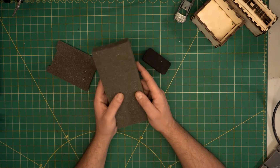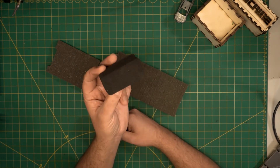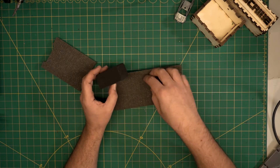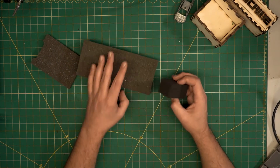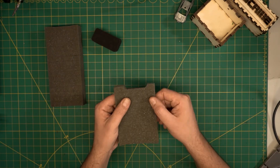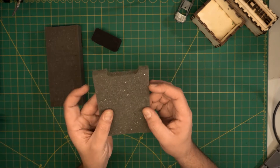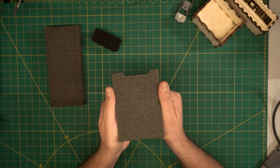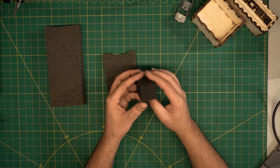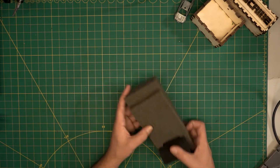I made a lot of things out of foam — the kind you get in Peli transport cases. You can cut out custom shapes; this is the leftover piece from cutting out an insert to put something inside a nice little box. Yes, foam stinks and it might burn, so keep water and a fire extinguisher handy. It cuts very precisely — you can cut nice shapes with the K40 that you could not do as easily with a knife, because the laser is at the right angle and the lines are very straight.